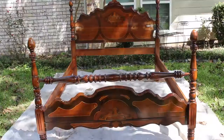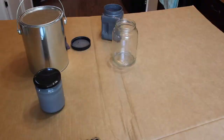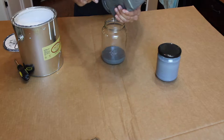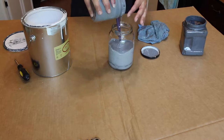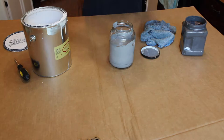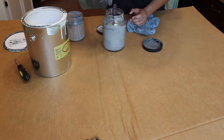For the next part, Cory chose to move outside because he needed all the room to spread out and set the bed. He's working in a well-ventilated area, so that's why you don't see him wearing his respirator. For the next part I wanted to mix a very specific shade of gray — a very soft gray with some warm undertones. You can do this with any of your paints if you don't have a color you want. In my case these were Dixie Belle Fluff, Gravel Road, and Hurricane Gray, and then I ended up adding a brown later on. The trick is to test it on a scrap piece of wood or on your piece of furniture — you want to see how it looks when it's dry because there can be a difference.